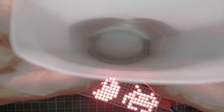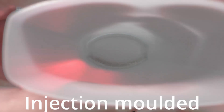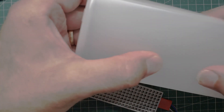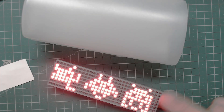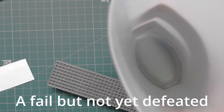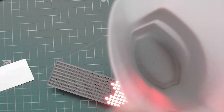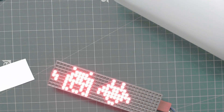I'm worried about the middle section - it may not want to squash because it's obviously being cast oval. But this is quite squidgy, if squidgy is a word, so possibly if I cut this end off, which is actually giving a lot of strength to the side walls, it would work also. So I'm going to go back into the CAD model, put a black marker pen around the end I've cut off, scan it with an inkjet scanner to get the curvature, and then model that in CAD and 3D print another section to stop the reflection. I'll see you in a few hours.